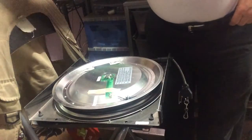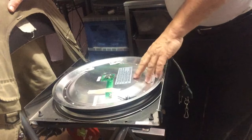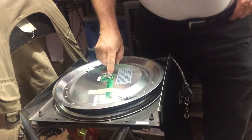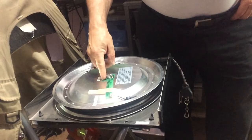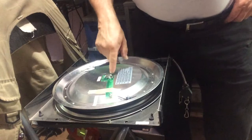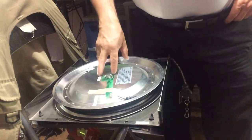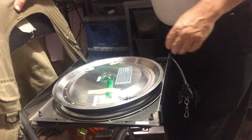Replacing the spring is a bit more of a pain. It's always easier if you have a problem with a Vivero spring to replace the whole spring pack — don't replace just one. You have to unsolder these three wires, one going to each spring, lift it out, and there's not a whole lot of room to put it back on. There are also nuts holding it in place. The first time I ever saw this done, Donald Clinton helped me and it took about an hour and a half to get it back on. If I ever have to do a spring replacement, I'll show you the technique that Mike Murgans showed me — it makes it a lot easier, although it's still irritating.